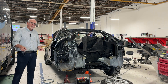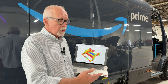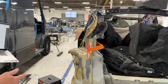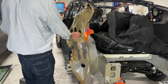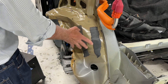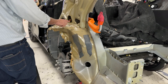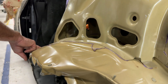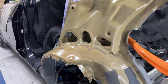All right, so how easy is it to remove a quarter panel? Let's take a look deeper. Now the quarter panel is off and we've got access to the rear gigacasting and some of the rear inner structure. On this one, you can see we've got outer wheelhouse damage here and here, which is going to require replacement. There are quite a few other things that need to happen because this panel is underneath the one in front of it, so a few more pieces will need to be replaced.